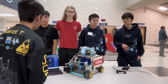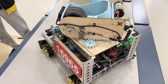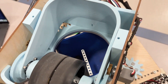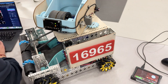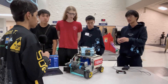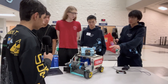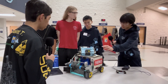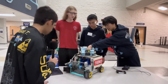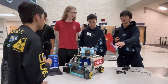Let's start with your intake. Why don't you tell me what wheels you're running, what RPM, and anything else you want to share? So we're using 48mm diameter gecko wheels, and we're using two vectored wheels as well, because sometimes the intake would jam with two balls intaking directly — we like to intake directly on the wall during autonomous. Using those two vectored wheels allows us to avoid that jam. We're running 435 RPM, and it's a belted system. The whole transfer system goes from the intake here, which sticks out around 25mm, all the way to a gecko wheel up top, powered by one belt. That allows us to have constant compression throughout the entire build.